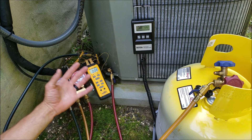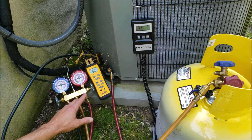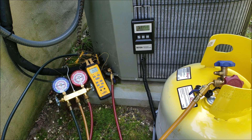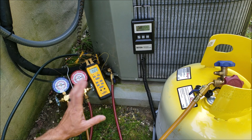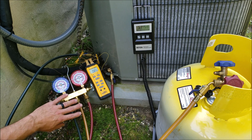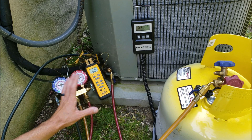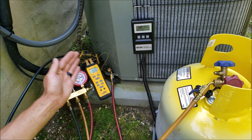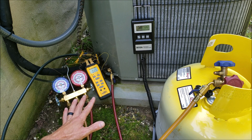The other issue is if somebody tried to recover a large amount of refrigerant — say the whole system's charge — that could end up damaging the compressor, especially a scroll compressor. On a scroll compressor you need to make sure you have at least 5 to 10 PSI on the low side, even when pumping the system down, because it uses the refrigerant coming into the inlet as insulation for the electrical windings so the scroll compressor doesn't short out between the electrical windings and the ground frame. Also, the compressor always uses the refrigerant to cool itself and refrigerant oil to lubricate itself — so if you don't have much refrigerant going to the compressor, you don't have much refrigerant oil going to the compressor. That's why you would only use this method to slightly adjust the charge in an overcharged scenario.